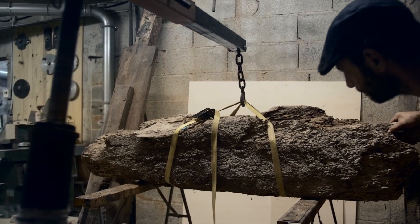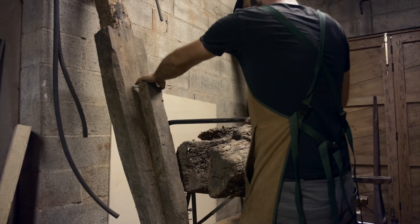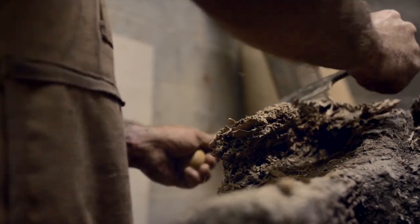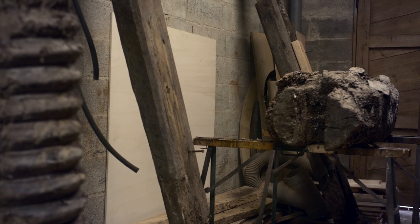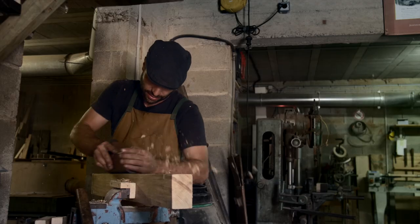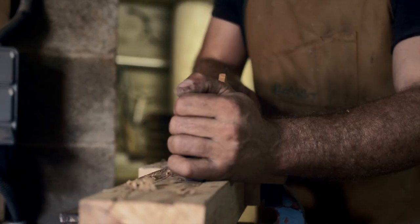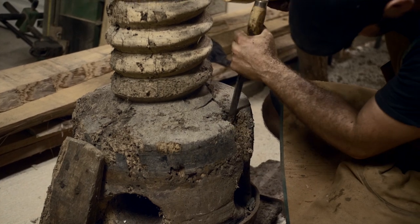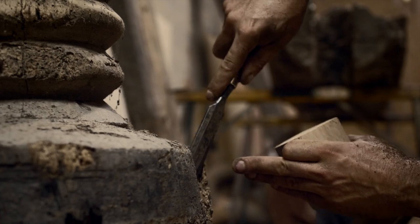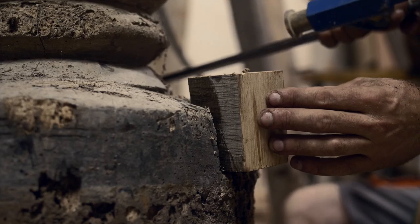Now I'm going to do a small restoration. In this piece, we don't have to worry — the insects have done their work. I'll clean it up so that it functions as it should, in a state where it looks as though nothing needed to be done. I reflame the piece of wood — this is the piece that used to guide the screw to go up and down. I try to find the wood as similar as possible. I'm going to insert a new piece of wood, the same species, glued into the original, then adjust it so that it looks as if nothing was ever missing.